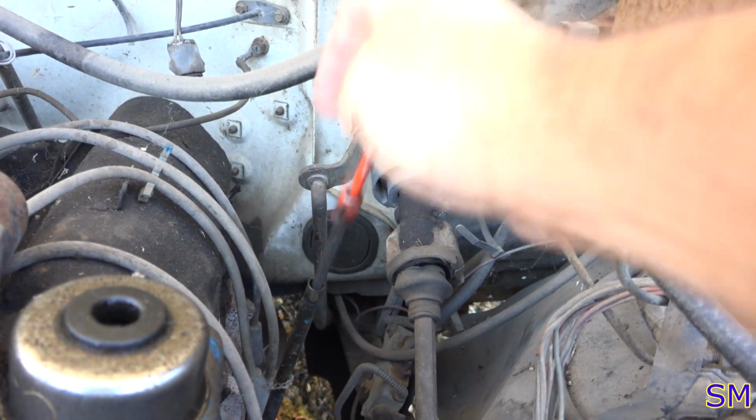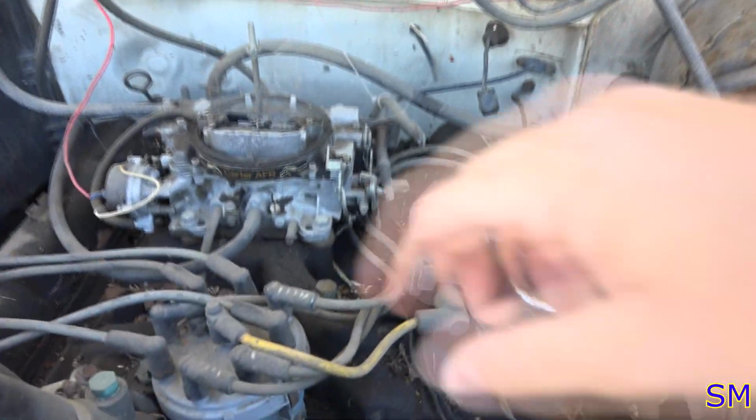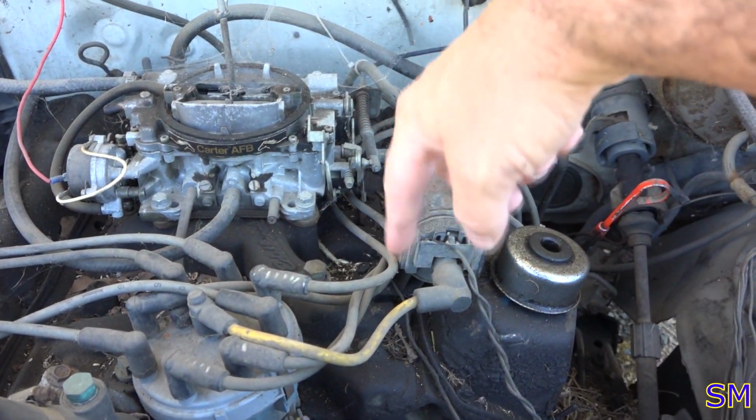These motors have been known to crack, but that was, I think, early to mid 70s. They would crack along the valve body, or the valley where the lifters are. But what I'm hoping is it's only a couple blown head gaskets. A $100 gasket kit from my local parts store, NAPA, and it should be going again, in theory. And unlike the other car, the carburetor here isn't frozen. Check that out, right? I know, it's gonna be awesome, right?